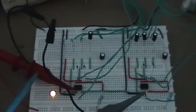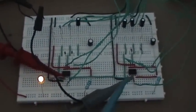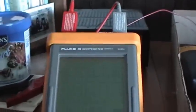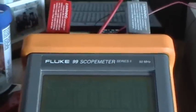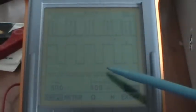These are two scope probes. This red one here is on the frequency and the gray one here is on the gating. Here is the meter I'm using — it's a Fluke 99 scope meter. Here's our square wave. This bottom one here is probe B, that's the gating. This top one here is probe A, that is the frequency.